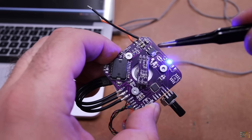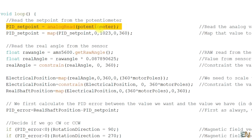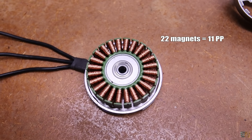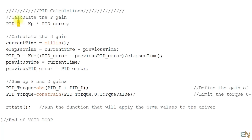Now let's look at the closed loop code with PID control. First we read the potentiometer for the setpoint, then get the real angle from the magnetic sensor, then calculate the electrical angle. My motor has 22 magnets — 11 pole pairs — so one full real rotation equals 11 electrical rotations inside the coils. We map the real shaft position to electrical rotations. Then we calculate the PID error, decide clockwise or counter-clockwise rotation, and compute the PD output — I haven't used the I variable. P is just the error multiplied by the P constant; D uses elapsed time and error difference.